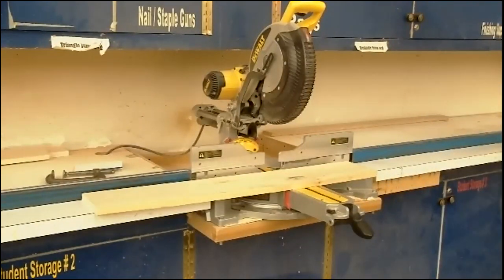Next one, our order of operations states that whenever possible or prudent, you should always mill the what of a board, then the what of a board, then the what of a board. Now that's a pretty messed up question, but all it's asking is what is our order of operations, okay? We already told you that it's thickness, then width, then length, okay?